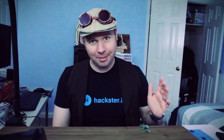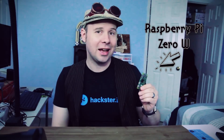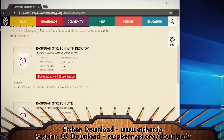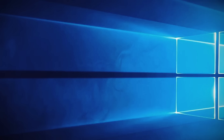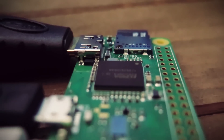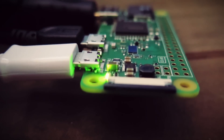For long-time subscribers, it should come as no surprise that for this project I'm going to be using a Raspberry Pi — in this case, a Raspberry Pi Zero W. As it sits right now, this Pi is pretty useless, so let's get it up and running. To do this, we need to download and burn the Raspbian operating system to a micro SD card. Once you have that done, insert it into the Raspberry Pi, plug in a monitor, keyboard, mouse, and then the power, and let's set it up.